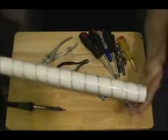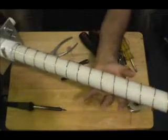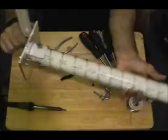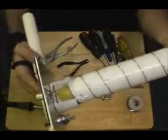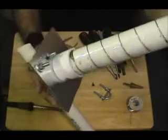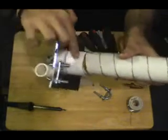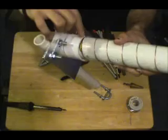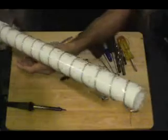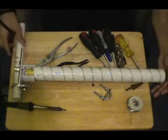I got all of the elements lined up. Used plenty of packing tape — not the best material of choice, but it does the job. If I had some two-inch diameter heat shrink tubing, I'd definitely use that to make this completely non-movable. Here's a close-up of the solder joint on the end connector and the solder joint leading into the actual driven element. When you're lining up this metal shim inside the end cap, make sure that it's in the exact angle — or close enough to the angle — of the actual spiral that follows all the way down the tube. It's not the prettiest antenna I've made, but it should work pretty well.